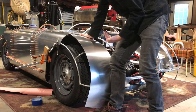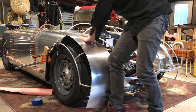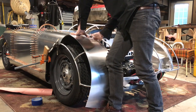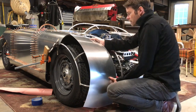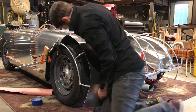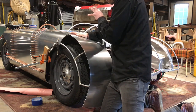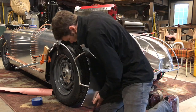Right through the middle's got to get hammered up a little bit. And we're seeing that now because the panel is touching out here. Okay, we're touching out on this outer perimeter, and then when it touches on the center bar here, it's lifted. It's kind of taken off this way. That's why we know we want to get that crown on it coming up and out.